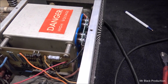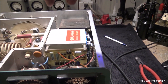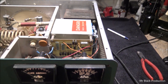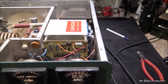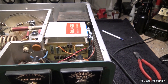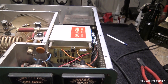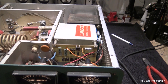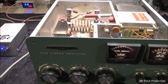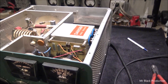We went in and put a new high voltage capacitor bank in it. I like to use a capacitor bank with the long ones. You can get the cheap ones with short little caps — they work okay short term, but heat gets to them after a while. I prefer the big long ones, the $140-$150 ones, just better caps. We also cleaned up some of the goo around the tuners, and on the bottom side we grounded the grids on the tubes.